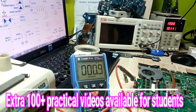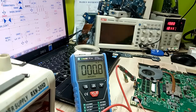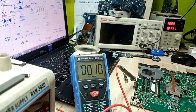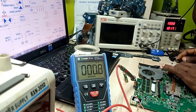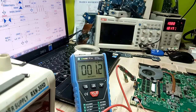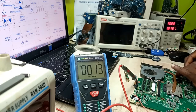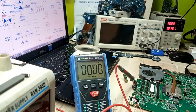The board is now stable. But the point is, if I turn it off and turn it on again, it will go back to its previous state — until I properly fix that AC OK signal issue. I don't have a screen connected right now so full display testing isn't possible.